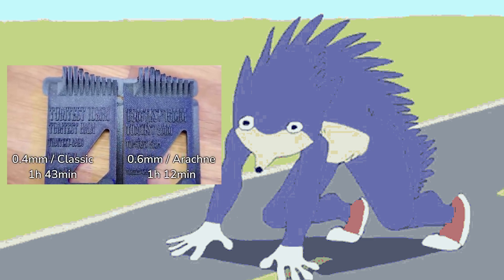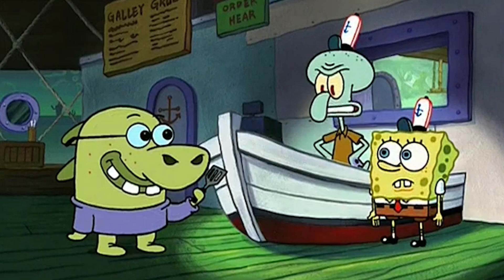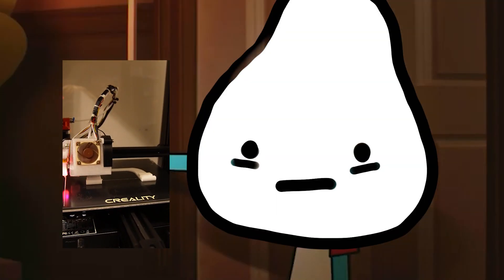There are two really advantageous points Thomas talks about with 0.6mm nozzles that stand out for my workflow. The first is print speed — with a wider nozzle, generally more filament is coming out, so you can print a lot faster than with a 0.4mm nozzle. This is perfect for me since time is generally the most painful point of any 3D print. I can only 3D print during the day because when I turn my printer on, it makes my lights flicker. So I restrict my print time to daytime, meaning I usually can't print anything that takes longer than 12 hours with a 0.4mm nozzle.